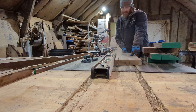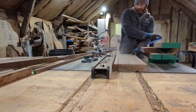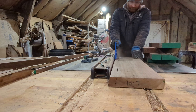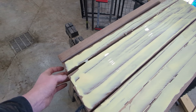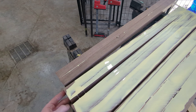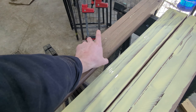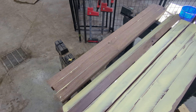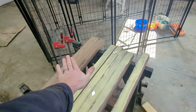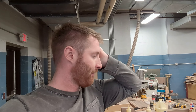I'm a glutton for punishment, so the back panel on this coat rack is going to be a little crazy. My idea is to do a chevron end-grain pattern across the whole thing. It's a five-foot by four-foot panel, so this is essentially going to be the largest end-grain cutting board you've ever seen. I cut everything at an angle and matched it so I have two parallel angles on each side, then I'm going to make this little glue-up and cut them into tiny strips.